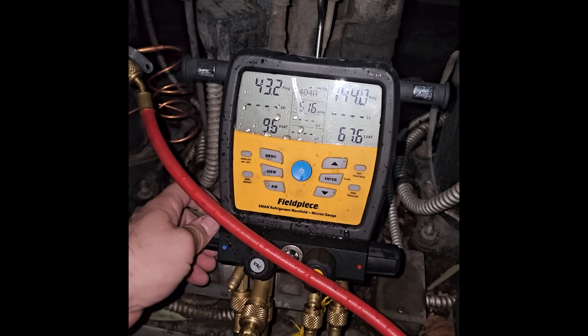My method of purging the lines — I'm going to open this up and open this up. I opened the high side already, so we've got gas right here. When I open this it should start feeding because I left this loose. There we go — that's how we purge it, and then just tighten it on. Now we know all the gas we recover is going to be clean. This is a clean vacuum-down recovery cylinder too. I'm going to put a scale under this and weigh the charge as we're recovering it.